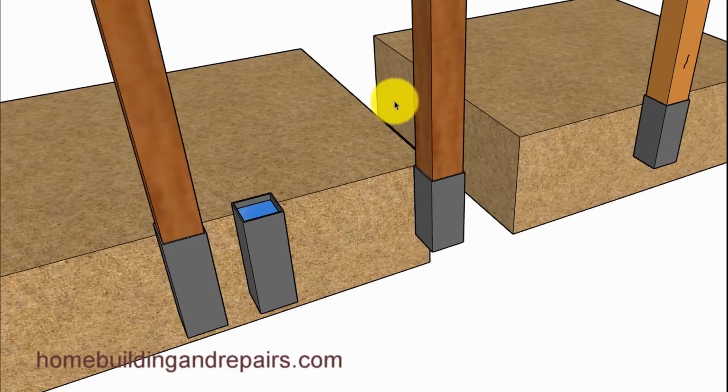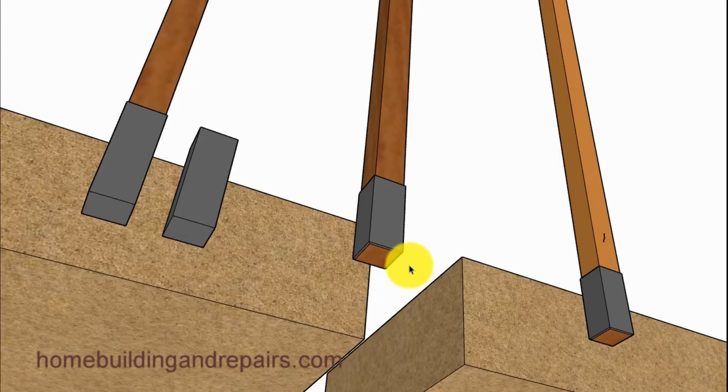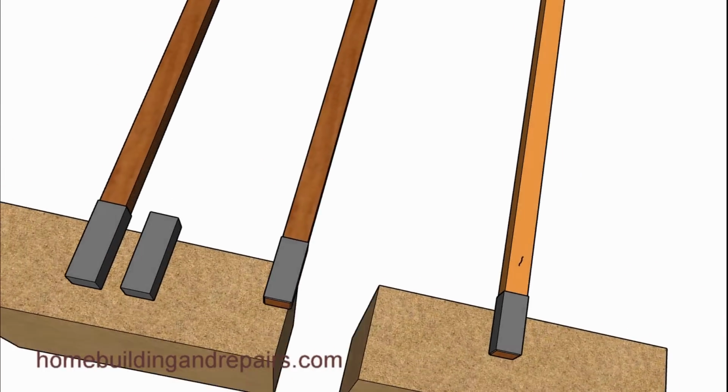Here's a tip that I'm not a big fan of any of these methods, but I want to provide you with my reason why. What if you wrap the bottom of the fence post with some type of a material that would prevent water from absorbing through the soil or the concrete into the bottom of the fence post that's buried in the ground? Well, if you seal the bottom of the fence post entirely, you're going to create some type of a waterproofing cup. And it's going to actually trap the moisture. Any moisture that gets between the wood and the sealant, whatever you're using, could actually work its way down to the bottom and have no place to escape. Whereas if you leave the bottom open, the water can escape, but at the same time, now you could have water being absorbed from the soil or the concrete from the bottom and then starting to rot this out. So I'm not a big fan of these ideas, like I said.